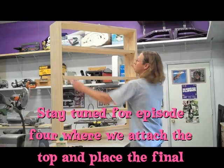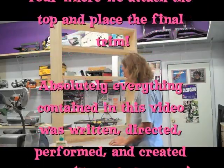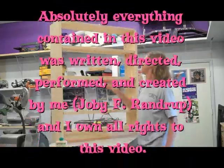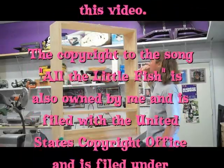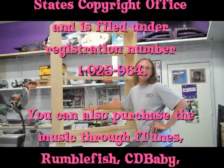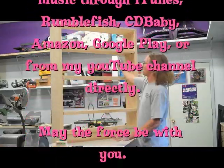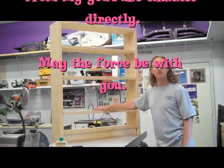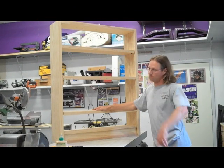We've attached our vertical boards and built the three shelves. Did the shelf jig so that we can adjust these shelves anywhere we want and put the faces on the shelves. Next time I see you, we'll do the top, come out the back, and be ready for finish. This is Joe B. Randrup from Rat Trap Productions — out.